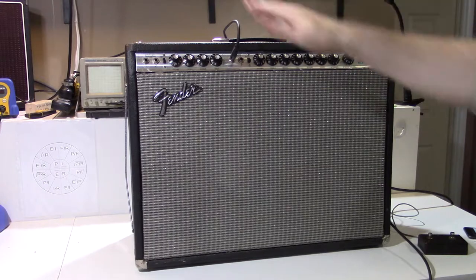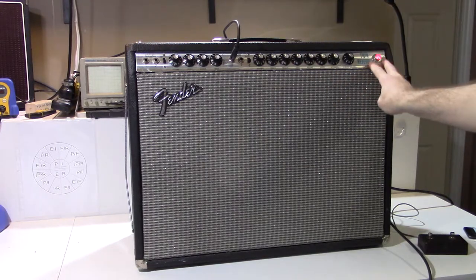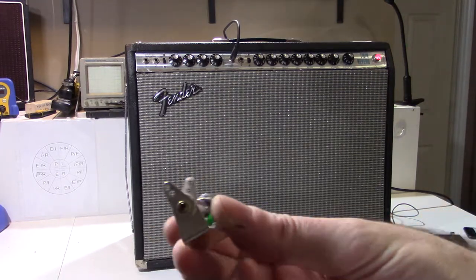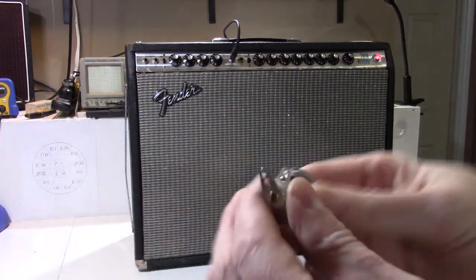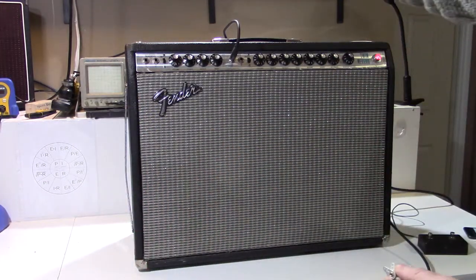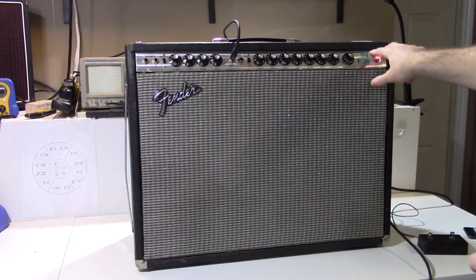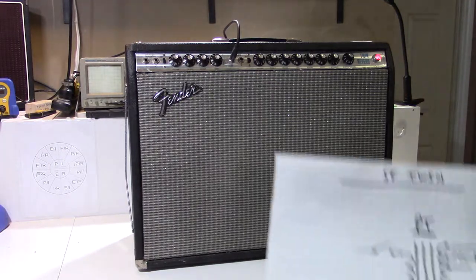What the filament wires do is they first go from the power transformer, there's usually two wires, right? They go to the indicator light. I have a pilot light assembly. It looks like this on the inside. So they go first here, and then they go to feed the filaments to all of the tubes in the amplifier. Now, because there's no center tap, that means that you have to run a couple of 100-ohm resistors to ground to basically remove noise and ensure that that circuit is properly grounded.